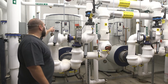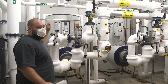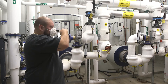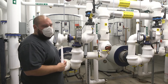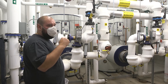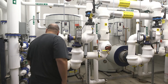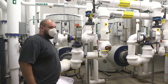The red number on top — there are two different numbers: a red number and a yellow number. There are two sensors in the tank. The red number is the upper sensor — what you're basically putting out higher up in the tank. The yellow number is the lower tank sensor, and that's basically your setpoint sensor. So when you do your setpoint, it's going off the bottom number. You guys have electronic mixing valves, so that's doing everything automatically for you.